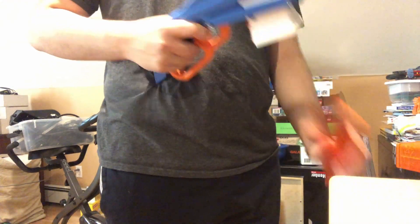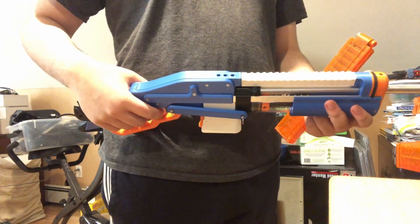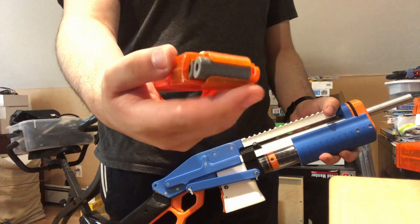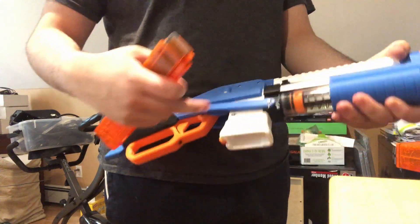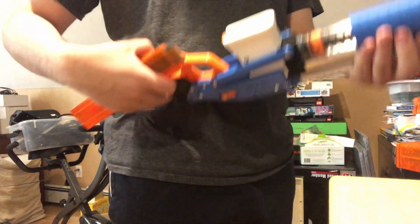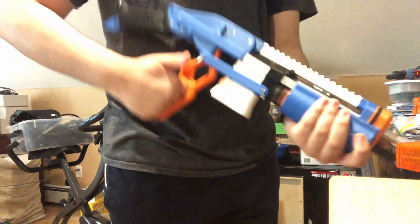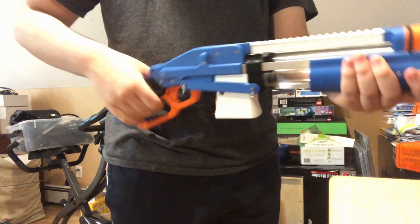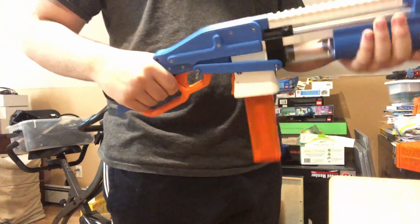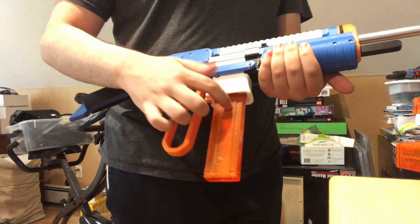This is the first prototype. I haven't printed any others of these, and I just assembled this like 20 minutes ago. Right now the mag clips — the lips of the mag right here — are rubbing up against these side panels, the big ones in there. So it primes really easily without a mag in it, primes really smoothly and easily. Once you put a magazine in it, the prime becomes much harder — and it's not because the spring is hard to prime, it's because it's rubbing with the mag feed lips.